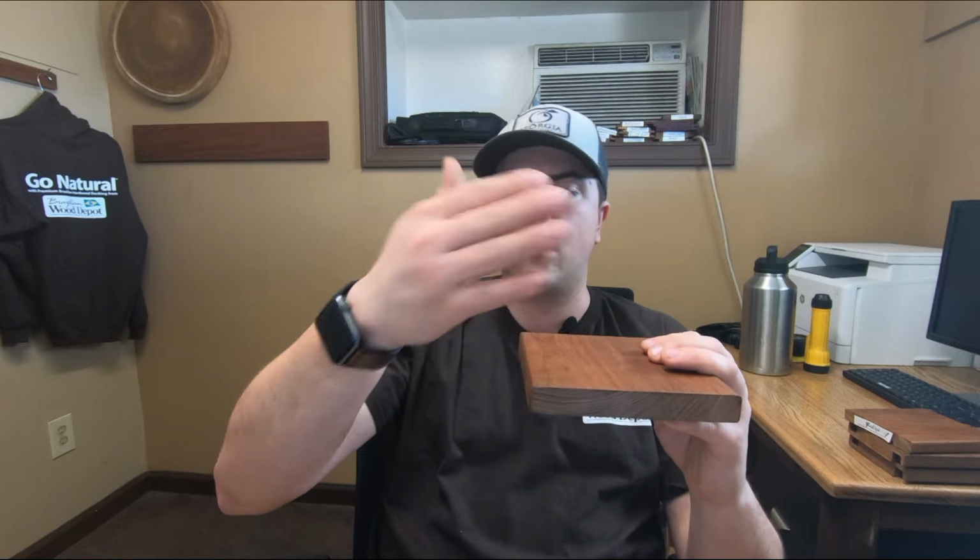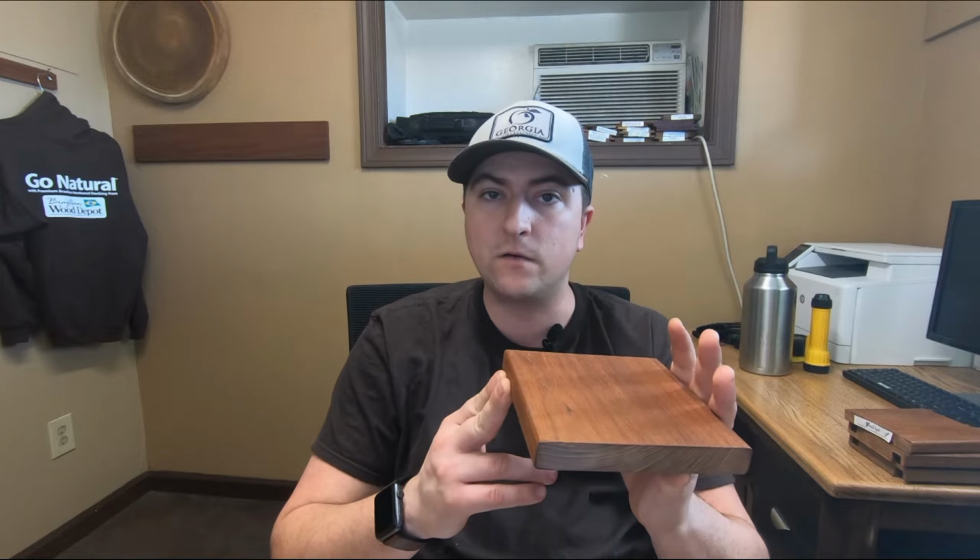The best situation for Ipe decking and wood decking in general is to have an open frame underneath that has some clearance, and not to close in the sides too much. When you start closing in the sides, you're constricting that airflow, so that when water and moisture falls in between the boards, it's getting trapped in this box that has a higher moisture content underneath, and then you've got a normal moisture content above the boards, which will change the moisture content of the boards themselves, which is what we're talking about. So elevation and airflow underneath the deck is always the best practice.